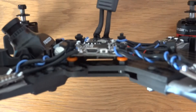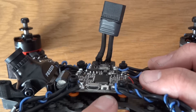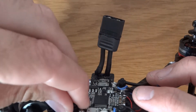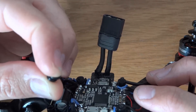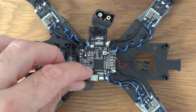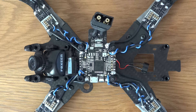Because of the space limitations, what I've had to do is run a nylon screw up here and attach that with a nut, and then on top of that I've used the softest silicone soft mount I can find, which sits against the board. On top of that I've used these really soft soft mounts — these are pretty similar to the ones you get with the DYS board and the Race Flight boards. Generally these little things sit in the flight controller holes themselves and you just slide the flight controller onto whatever you're attaching it to. Because they're really soft, I'm just sitting them on top of the flight controller and the nylon screws.